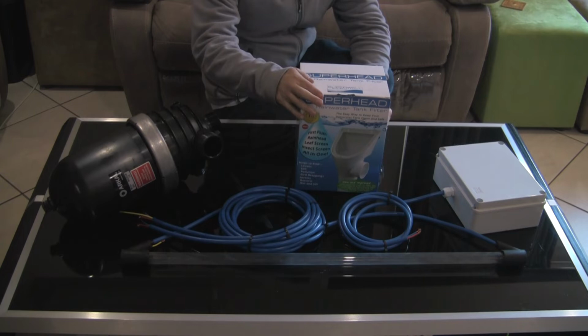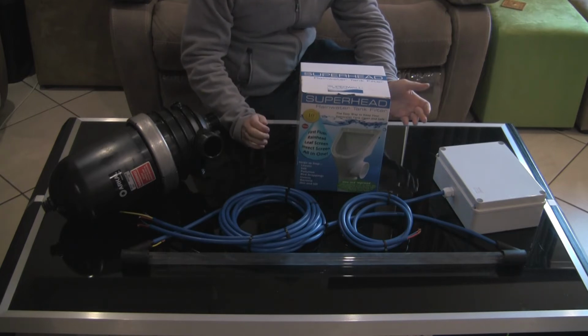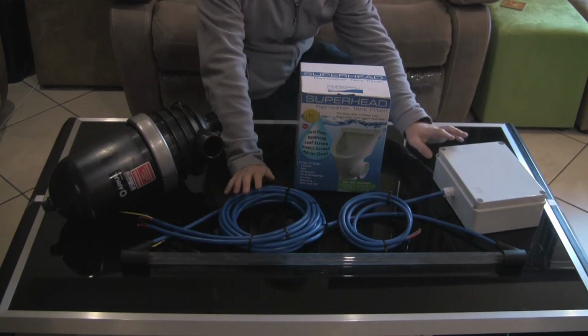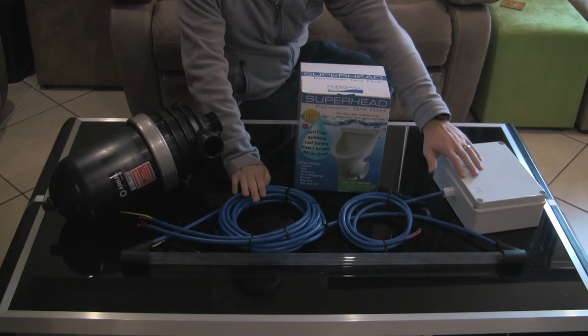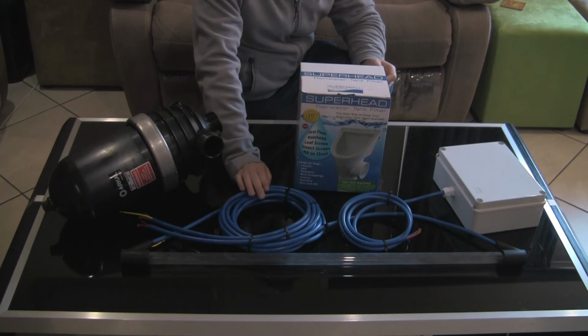From your first flush filter, you would go into your actual storage tank. Ideally, you would want somewhere between a 1,000 and a 10,000 litre tank, as those are the tanks that are compatible with our in-tank UV system. Now what this is, this UV light physically floats on the water inside the tank, and its control box sits on the outside of the tank. Depending on the size of the tank and how much nutrients are in the water, you can run the light for various lengths.